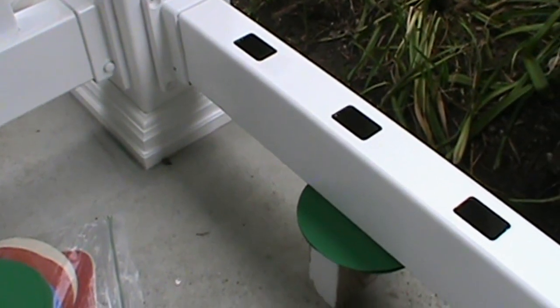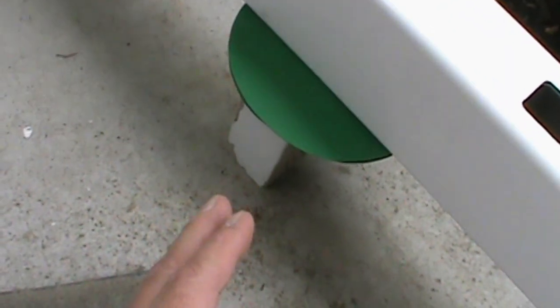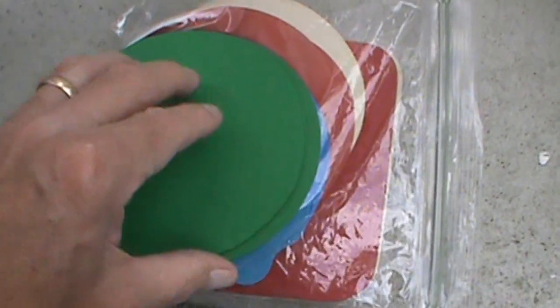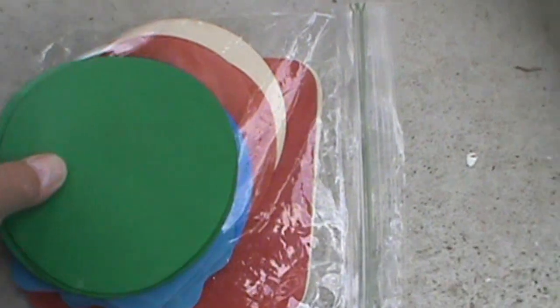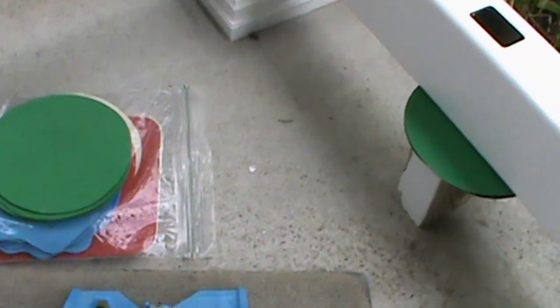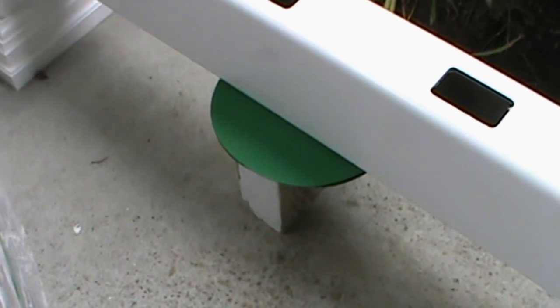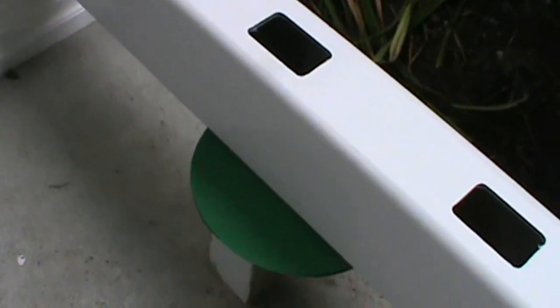Here are a couple of tips for leveling your rails — the bottom rail. I have a little block of wood under there, and these are just some old coasters — just a little rubber deal that you put down to set coffee on. They're probably a sixteenth of an inch thick or so. It's nice to just start stacking those under your rail as you start leveling it up. That'll allow you to take it up and down in small increments until you get it right where you want it.